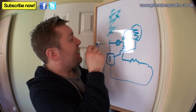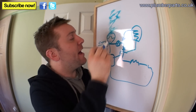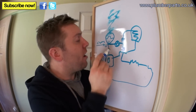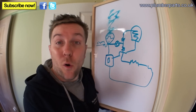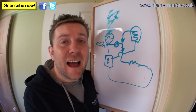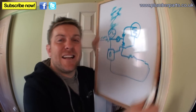Basically we have a cold water main come in, goes through a filling loop, into what we call the manifold that's often at the bottom of the expansion vessel. If you want to know the principle about how pressurised heating systems work, watch our video on pressurised heating systems. You've got that filling loop, braided hose, a non-return valve and a valve. This braided hose is removable so the system doesn't automatically or accidentally fill up off the cold water main, which could pressurise it, bulge radiators, and cause all sorts of problems. The water heats up and expands into the expansion vessel.